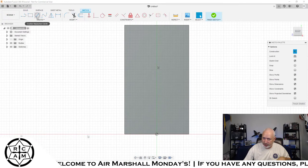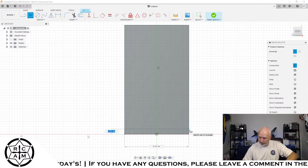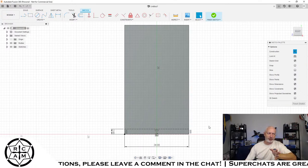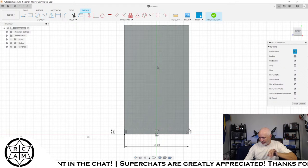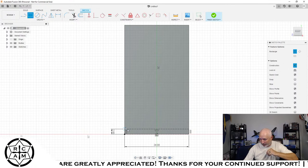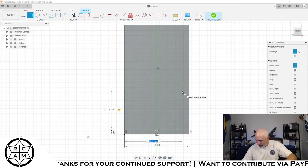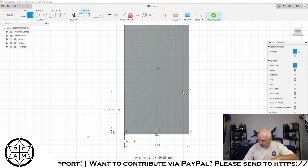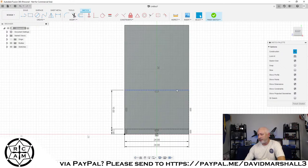We're going to do some construction lines, just for reference lines, right? Which is what the construction lines are. They just offer some points of reference for us to go off of. I already looked and I need to be about 15 millimeters high on this side. So I'm going to do another construction rectangle that's about 15 millimeters tall by 24. Not 4, 24. Right, so that gets me another line at 15 millimeters high.